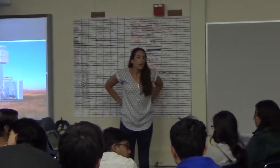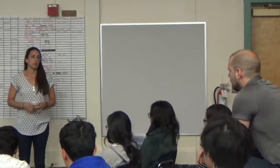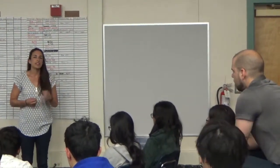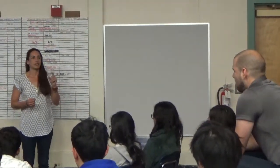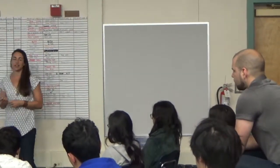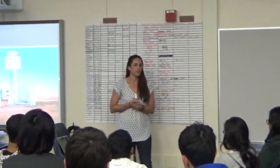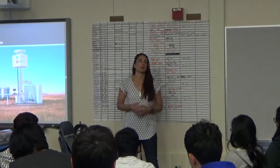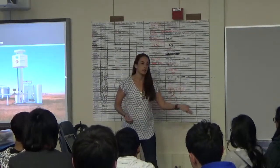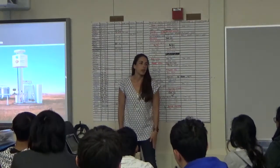On MEMS energy harvesting — yes, that's what I was doing in grad school. The devices generate very small amounts of electricity — microwatts if your device is good. You need very low-power electronics to power sensors using that kind of system. It's tricky to find applications where batteries aren't going to work fine for the lifetime of the part. But the power requirements keep decreasing and the power output of these harvesters keeps increasing, so they get better at finding applications.